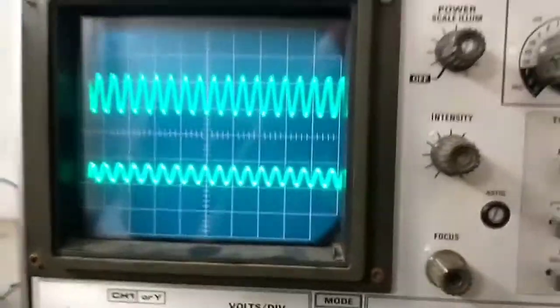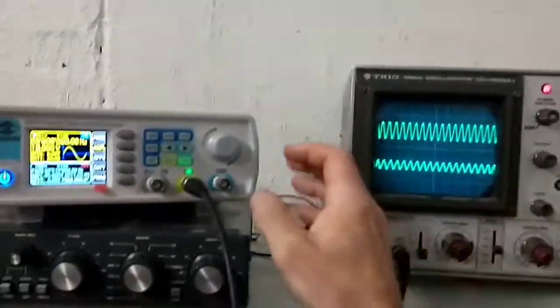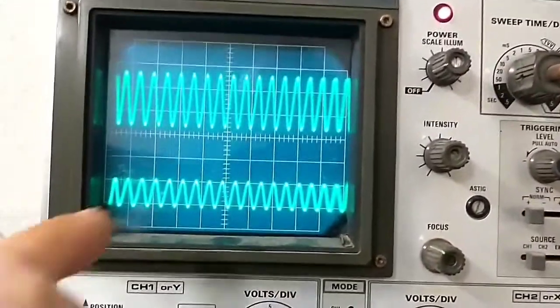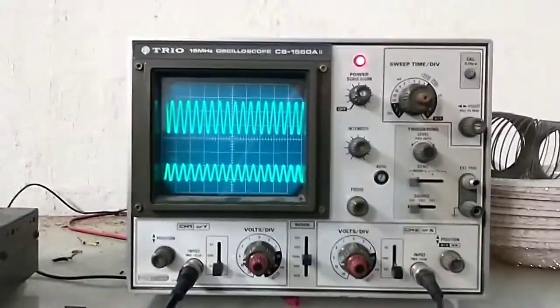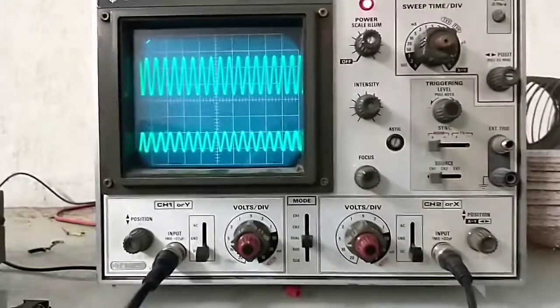We still have a difference. I'll try to get this in shot — terrible scope. We're at 10-volt peak-to-peak input on the 10-volt per division. I'll change that to 5-volt per division. You can see we've got these two waveforms again — one of them is over 5 volts and the other is probably a bit over 10 volts. I haven't got this well-balanced yet, but I'm just showing the basic concept. I do have the two versions of the RF signal but with a potential difference. I'll adjust the magnet again with a significant potential difference, so you can see how I can make these adjustments.